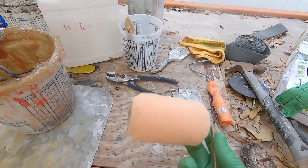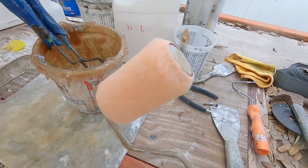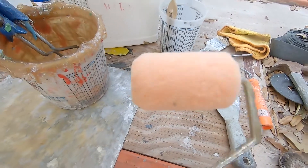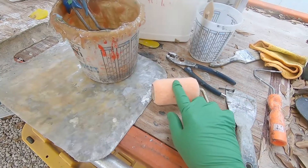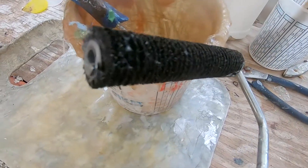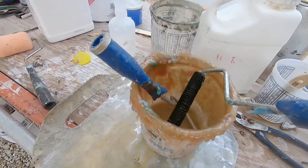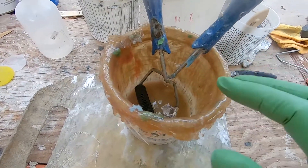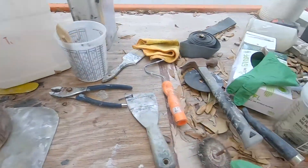Something I used to use is these paint rollers to do the laminating, and I personally don't like using them anymore. Mainly because they're expensive — two-fifty to three dollars each for a good quality one — and they also hold a lot of resin. When you're doing tabbing or any lamination, you want to put the correct ratio of resin into the glass, and having that roller loaded up with resin puts too much resin into the laminate. I use these specialty rollers from the boat store instead — the one with the black fibers to wet out the laminate, and the thin roller to take out air bubbles.